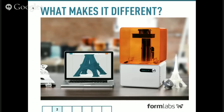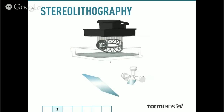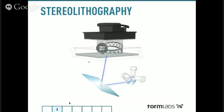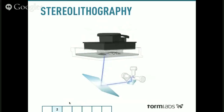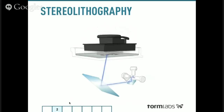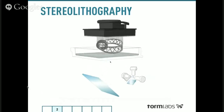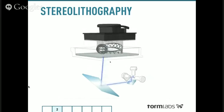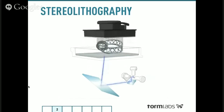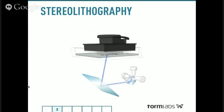What makes the Form 1 so special, particularly as more desktop 3D printers show up on the market? In very simple terms, the Form 1 is a stereolithographic 3D printer. This is illustrated by an animation showing an ultraviolet laser being reflected upward into a tank of liquid photopolymer. That photopolymer is cured in layers — it's a photographic process rather than a thermal one. This allows us to make parts with extremely fine detail, extraordinarily high resolution, and a fantastic surface finish.